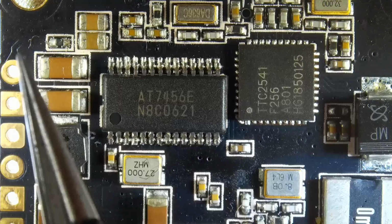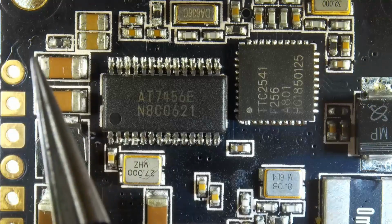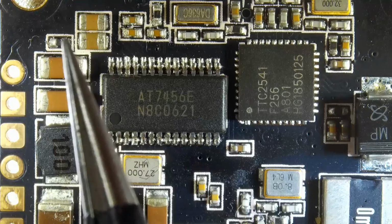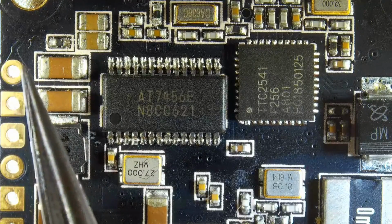I did trace it out. So if you ever trace out your video out pad, find the resistor and test it, because usually it would be a 75 ohm resistor. If it's reading 0 or something, then that could be the problem. That's if the pad's not working, so if you're not getting signal on the pad.